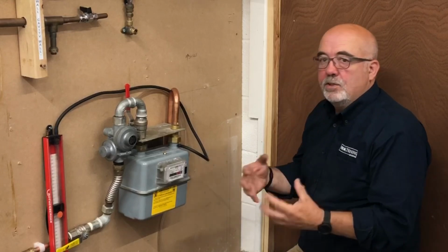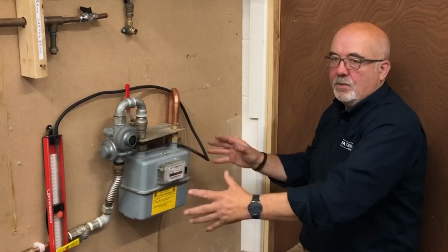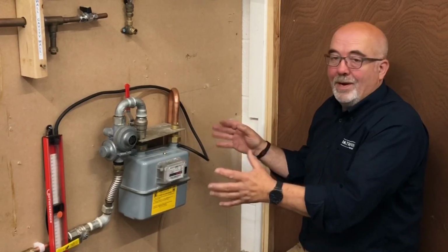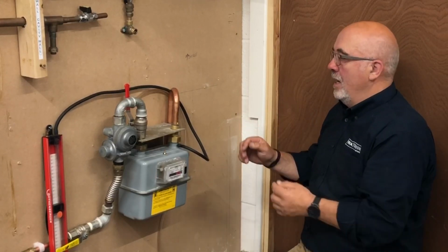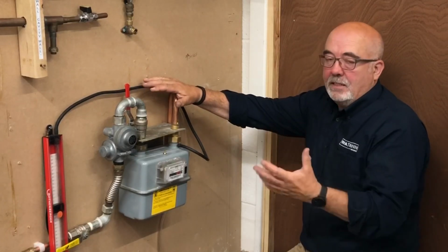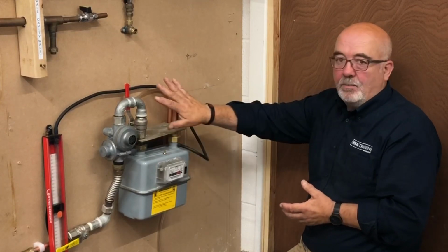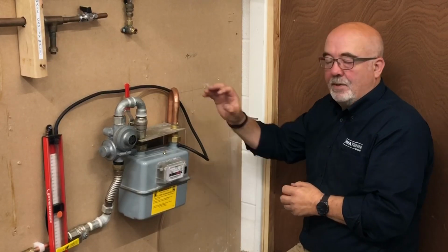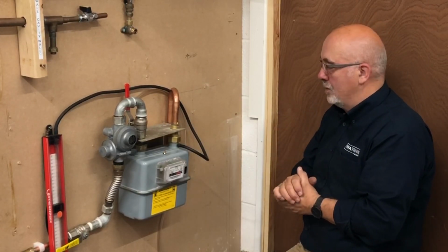Most of the ones you'll come across nowadays, now just bear in mind this has been set up so it's quite visual. In reality it would always be in a meter box. It will always be external. You never get one of these inside a property. And anybody who's put meters in a meter box, we've all gone through the wall at the back. That's a complete no-no on medium pressure. You're not allowed to do that, and the box should be labelled up accordingly. We'll show you the labels shortly.